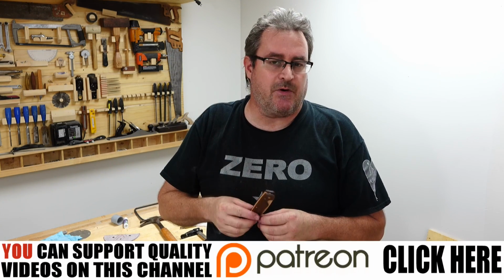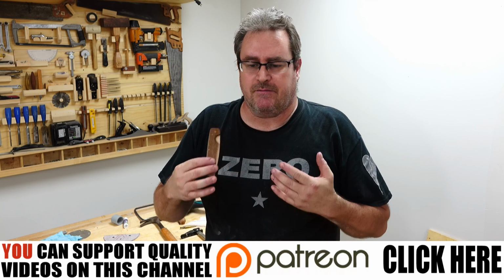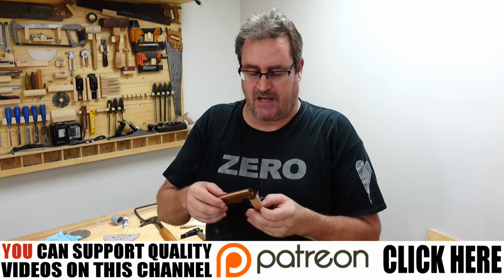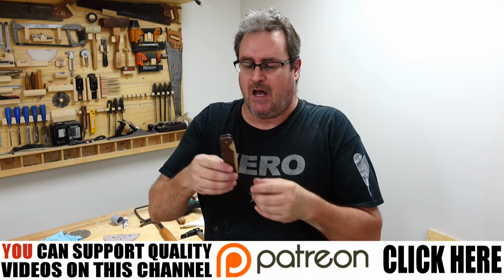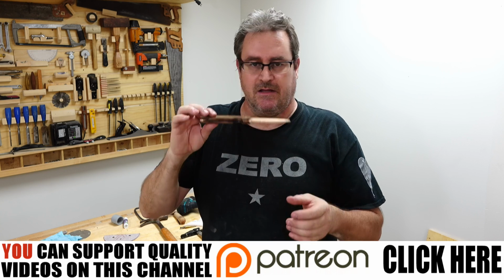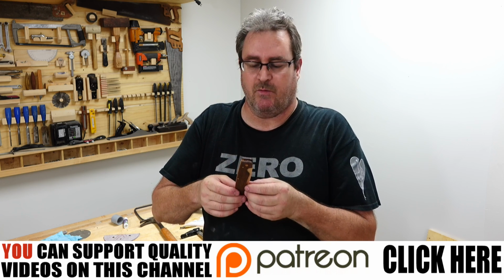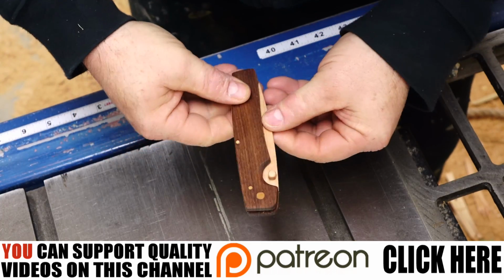The finish that I put on here was just mineral oil. I didn't want to put any kind of oil that would set up because that will actually glue the parts together and you really want the parts to move freely on this. I would recommend sticking to mineral oil after it's all assembled and working correctly. Oil it up and then every once in a while, put a little bit more oil on it. And it will work flawlessly if you do that.